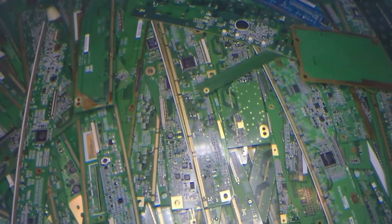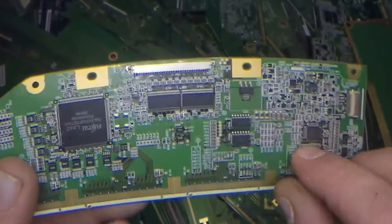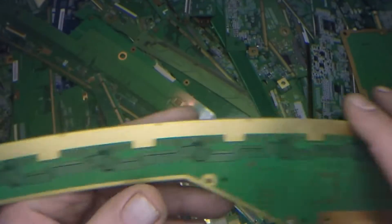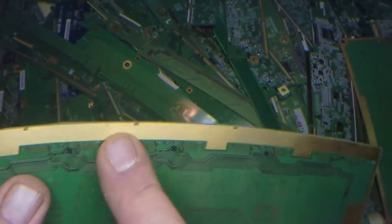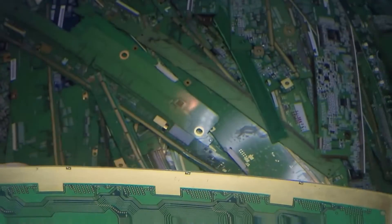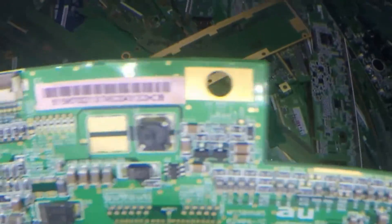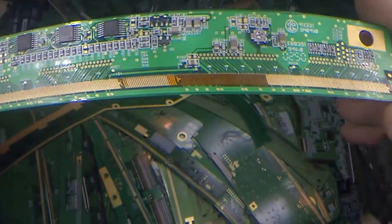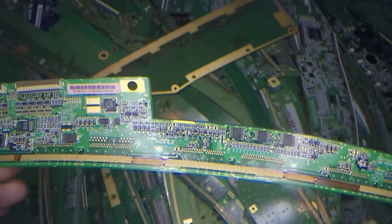So that's what I think the difference is between gold plating and gold flashing - what I notice on a lot of these boards. Not only is there gold fingers and gold traces here, but it's not plating, it's flashing. And as you can see here, it's very heavy. But not only is there just this kind of gold flashing, they also get right into it - even writing, brand names and logos, they'll actually even have that in gold as well. So there's no way someone is going to sit there and plate logos and all that writing. So yeah, it definitely is flashing.